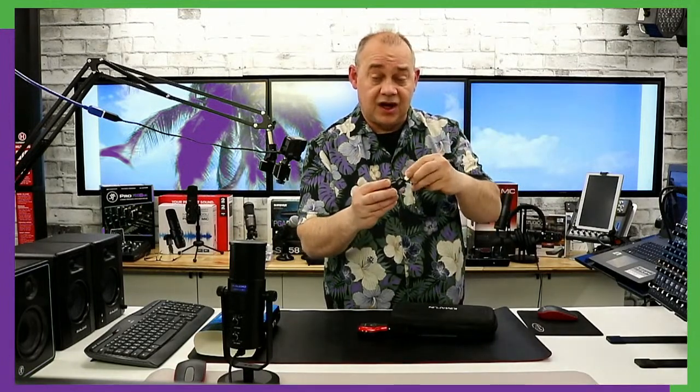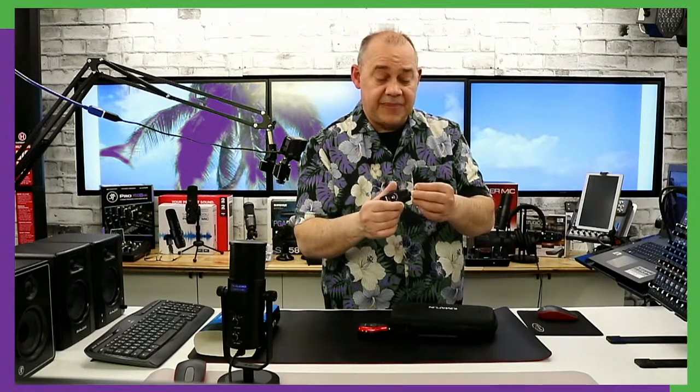So what I've done is I've used a short 3.5 to 3.5 adapter and extension. If I had a quarter inch extension, I would have used that, but I don't. I take the adapter off. I use my short extension, which gets it away from the mixer, because that's where the problem is. I get it away from the mixer, and that noise is gone. Just gone. No more background screechy sound. And you can tell it's from the mixer, because as soon as you move it away, it's gone. You don't even have to play it. You put this next to the mixer, and it's making noise. So we definitely know that the problem is proximity to some of the equipment. So occasionally, if you have that problem, just get yourself an extension so you can move this away to a part of the electronics that is not going to cause any interference.